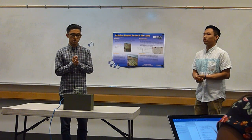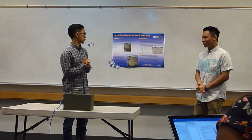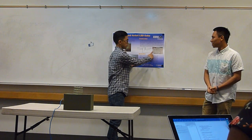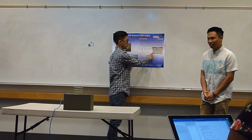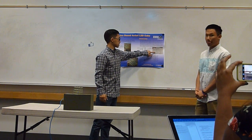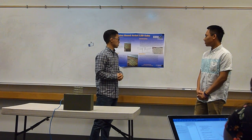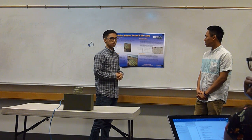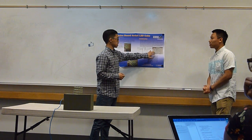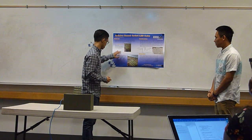After that, we took 2 uninsulated wires per layer, and then we were able to solder 4 of the rows to form just 1 layer of our cube. With this, we had 16 anode legs, and when we did the same for the other 3 layers and the rest of the 64 LEDs, we ended up with 4 layers. After this step, we decided to solder the anode legs together, which would lead to this structure over here.